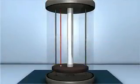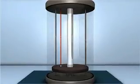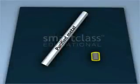By the time the heater reaches the other end of the impure metal rod, the impurities get concentrated there. The end of the metal rod with concentrated impurities is then removed and discarded. The same process is repeated again and again till a highly purified metal is obtained.